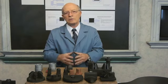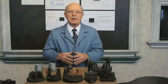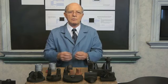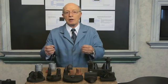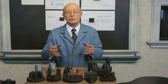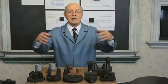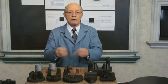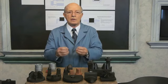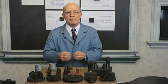Another important factor, Steve mentioned a little bit about it, is the hardness of material. That's what's unique about doing EDM. The same for wire. It doesn't really make any difference if it's hard or soft, or if you've got these exotic metals or materials. It works through spark erosion, so hardness is not a factor in RAM EDM.